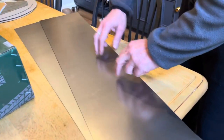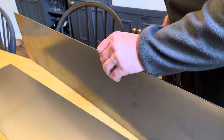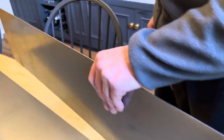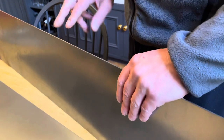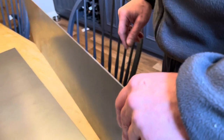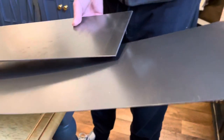Some steels arrived. Now this little baby — this is 2mm steel and that's for the chassis cross rails, all of the rails down from front to back. I've got a couple of repairs to do and 2mm is quite easy to bend and twist and hammer over my anvil, so that's going to repair the holes in the chassis and the weak metal.